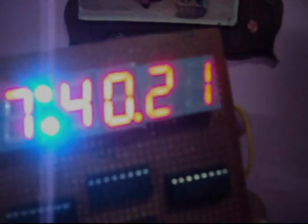This is the circuit for the digital clock which is running at 1 Hz. These are the 4026 ICs here. This is the clock running here, and this is the power voltage regulator. It's all running exactly at 1 Hz.